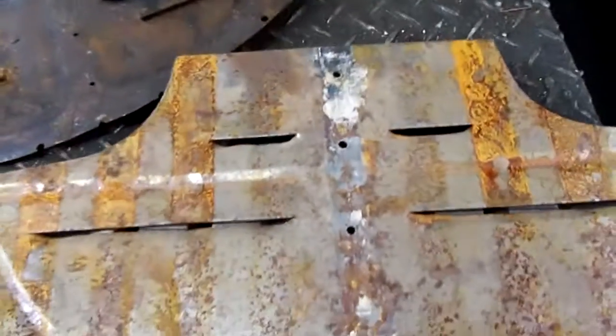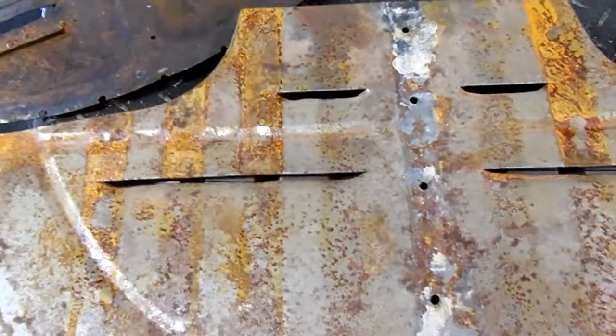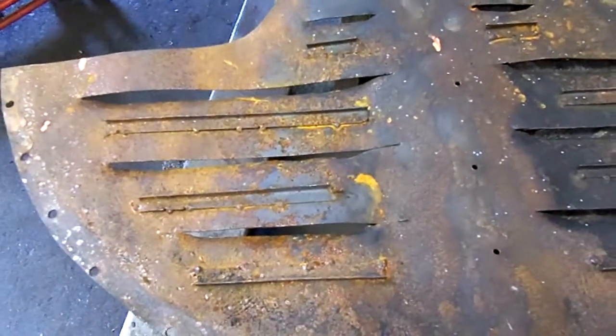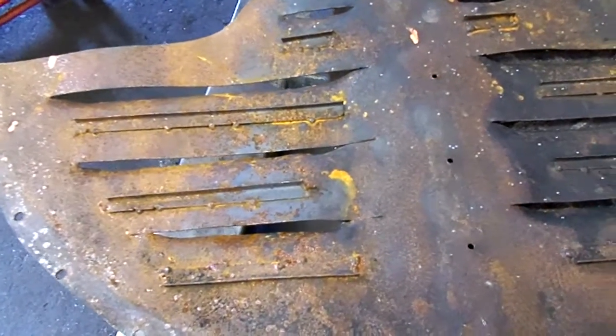Here's the inner pan that we took off. This one's made out of steel — only two openings. Should be four openings like this one. This one we took out of another burner. Should be made out of 310 stainless. But you can see the difference. It was brand new and it didn't work.